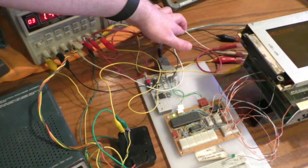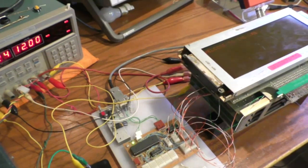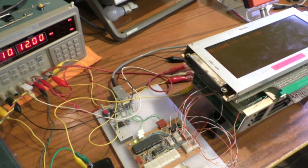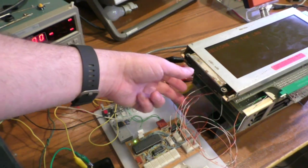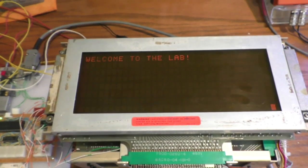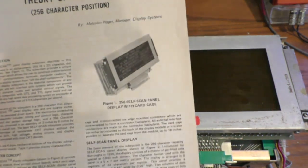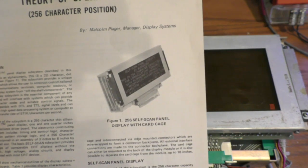Getting a little closer on my lash-up — there's a cable coming out with little plugs on it, so I've got my wires clipped in there. Since this has a 50-pin Centronics-style connector, I've actually soldered wires directly to the circuit boards in the card cage and brought them out, which makes life a lot easier. I would have used a connector but I don't have one. There's a close-up of it running in the manual — there's a little message on the display, and I thought it'd be funny to make this display say that same message.